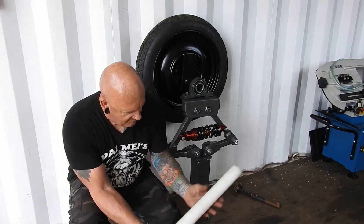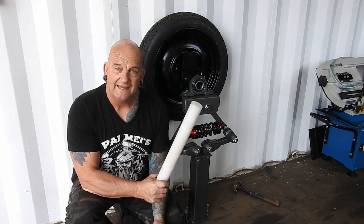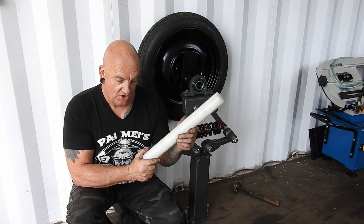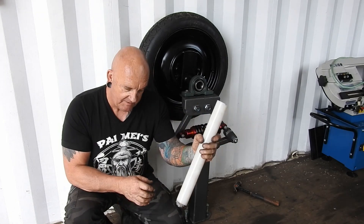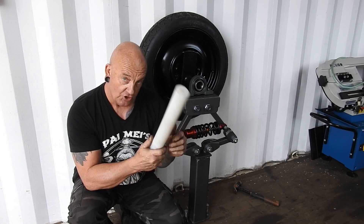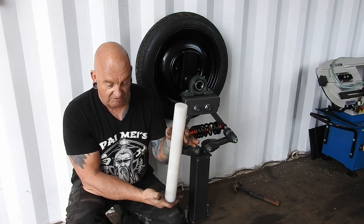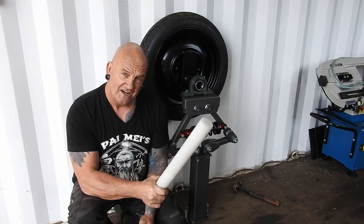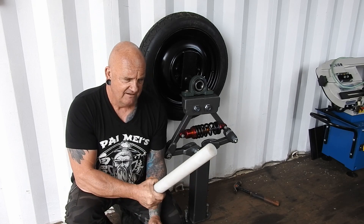What do we have here? A lump of plastic rod, you'd think. Well, it's not. It's UHMWPE — Ultra High Molecular Weight Polythene. What does the advertising say about this great piece of plastic? It's got outstanding abrasion resistance, superior impact resistance, it's non-sticking, it's got self-lubricating properties and excellent mechanical properties — even in cryogenic conditions. So it can be absolutely freezing cold, really really cold, colder than you can imagine, and this will still be slippery and still doing its job. Or even in space, it will still be working and still be slippery.